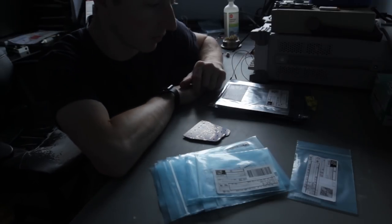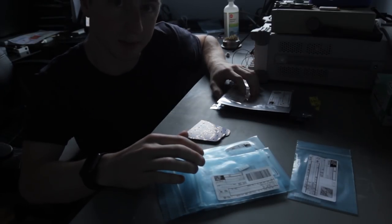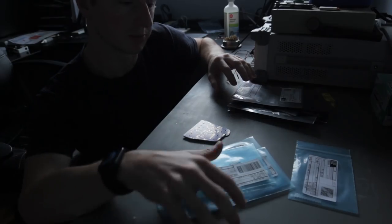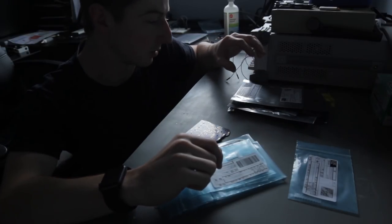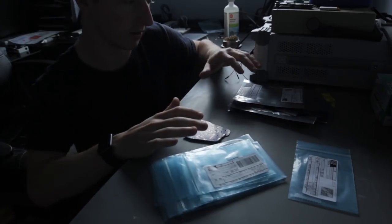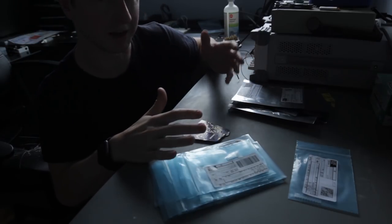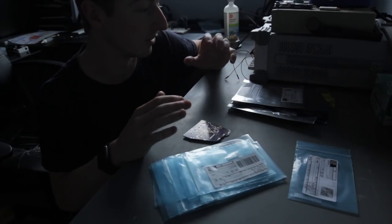The next thing I like to do is separate the components from the discrete components to the more complex ones — the ICs, the microcontroller, LEDs. Anything in anti-static bags I will separate out, and then separate the surface mount components as well. You're going to be installing all the resistors and capacitors first — all the surface mount ones. The second set will be the ICs like the microcontroller and motor driver. Once you reflow these in an oven, afterwards you can put all the through-hole components on. It makes sense to have the capacitors on the board before the ICs to eliminate possible chances of ESD, though it's never personally happened to me.